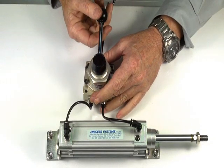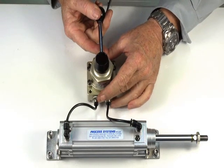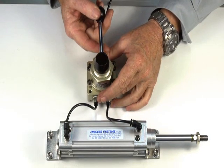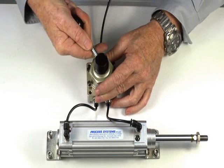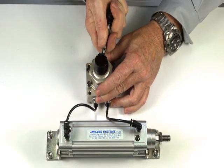It gives us control to lock the actuator or the pneumatic ram in that central position, and gives us speed control built into the actual valve so we can inch it and allow us to have some form of control over the unit.